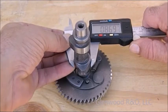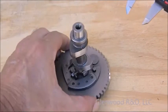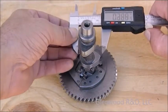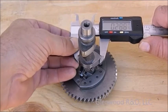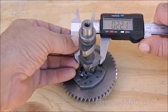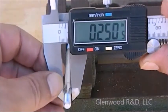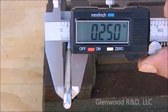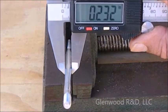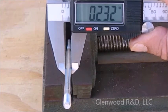Using a digital caliper, simply determine the difference between the round portion of the cam and the lobe, as demonstrated here. In the case of the Predator, the lobe is 221 thousandths of an inch. The narrow side of the Predator carburetor stud bolt is 232 thousandths of an inch. These extra few thousandths are needed for brazing prep and final shaping of the cam lobe.